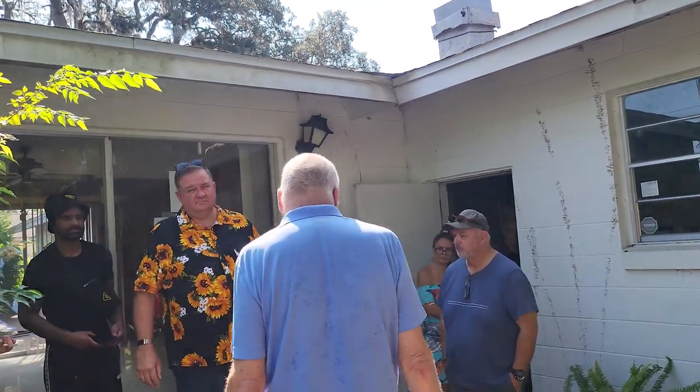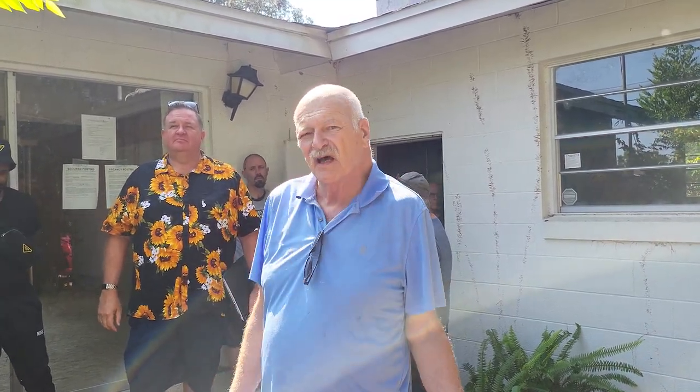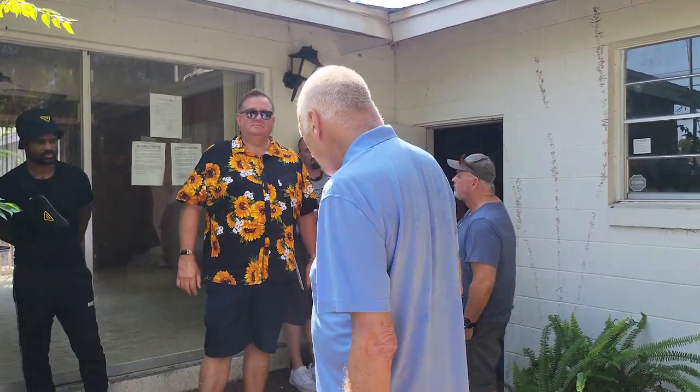This house was built in 1963. Anytime you're going for an older home, you want to check whether things like an enclosed screen room or carport have permits. Go to the property appraiser's office. Most building departments probably have records back to 2000, maybe 1990. If you find permits, you know the square footage is legitimate. The house we're doing nearby didn't have a legal bathroom — it was there, but done illegally. The carport was also finished illegally, and they got caught with code violations.